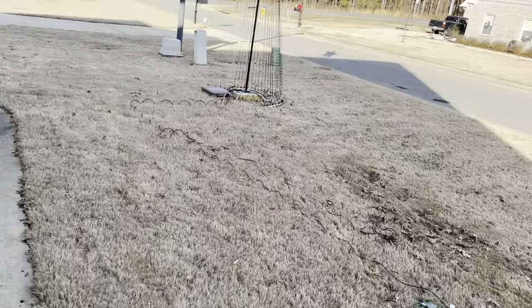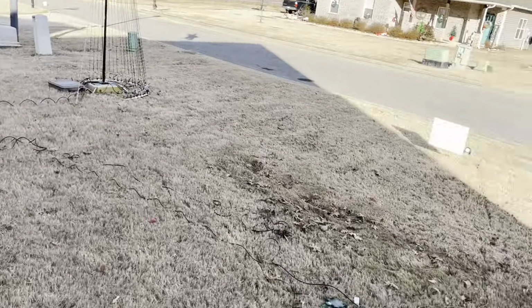We've got some arches I kind of made last minute. I wanted to try seed pixels in them just by running the seed pixel strips through, but they didn't look very good. There just wasn't enough light to create the cool arch effect you're used to seeing. So after I built them, I freehand drilled some holes as close to 2-inch centers as I can in the back, and stuck pixels in there, and it gets a nice wash. It looks good. The white PEX does a good job with that, so I like it.